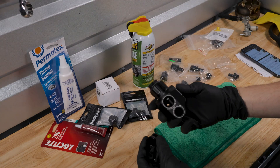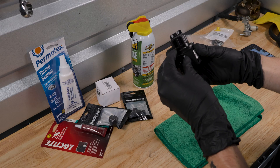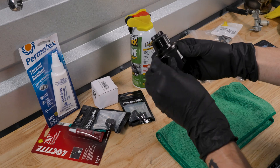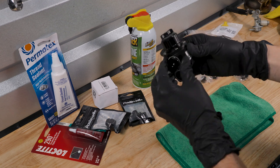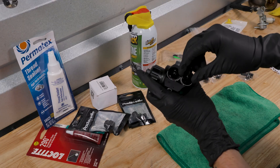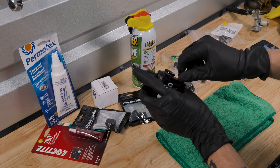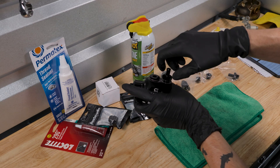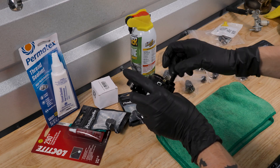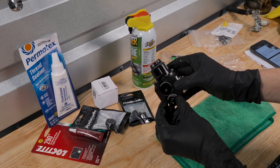As always with fittings, we're going to do this by hand first to make sure things go in nice and even. It felt like it didn't want to go in, but it does — and I can do that with just my hands, which means this is the right one. I'll do the same with the bottom port. Just make sure you're threading it in nice and evenly, and once you squeeze it in, that O-ring should get fully seated, creating a nice seal. We're going to go ahead and tighten these down.